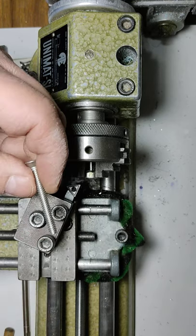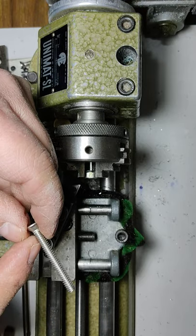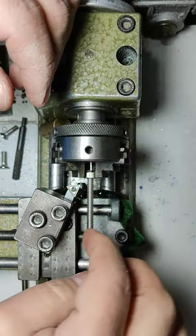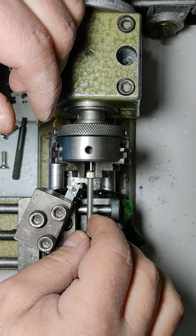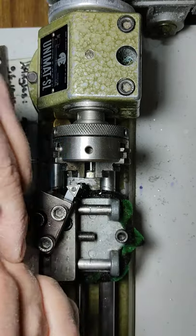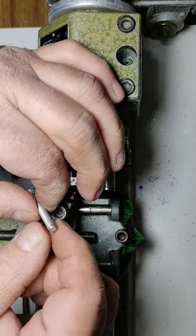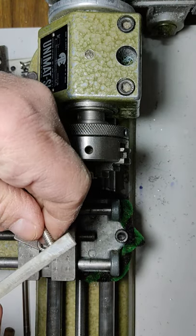The second thing before you start cutting: put a nut on there, just past where you want the material cut off — on the inside part, not the outside. This way, once you cut it off and file it, you'll have a burr around the edge. Take a file and run along it, twisting.